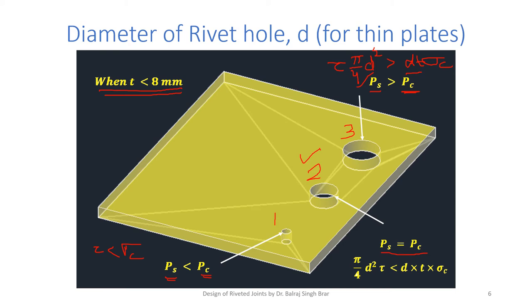For single riveted lap or butt joints, we have this relation: crushing area, the projected area DT, into crushing strength, and this is the shear area into tau. But if we have double or triple riveted lap joints or butt joints, we have to take proper care of how many rivets are in double shear and how many rivets are in single shear. Accordingly, we will find the shear strength and equate it with the crushing strength. Here also we will take care how many rivets are in crushing,